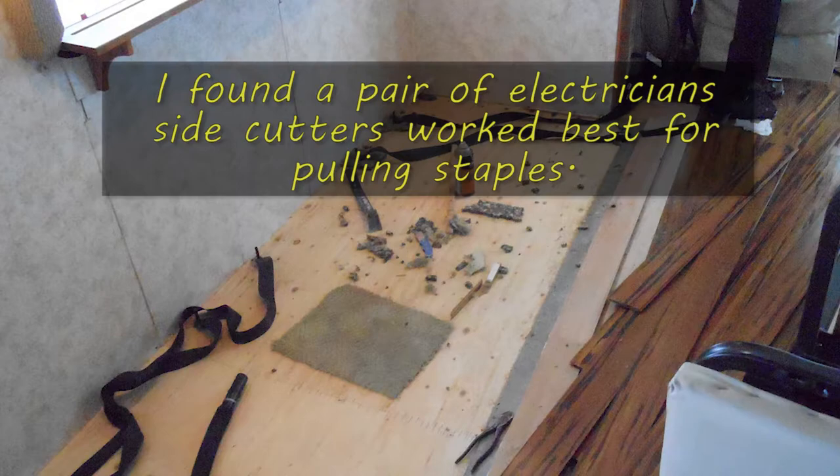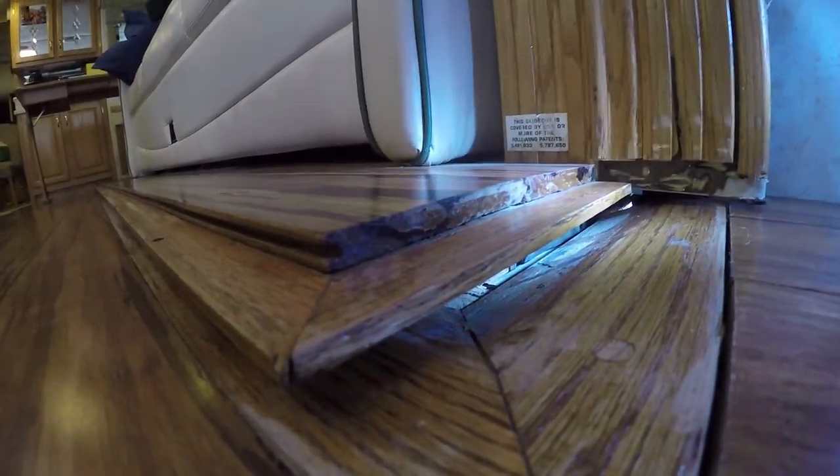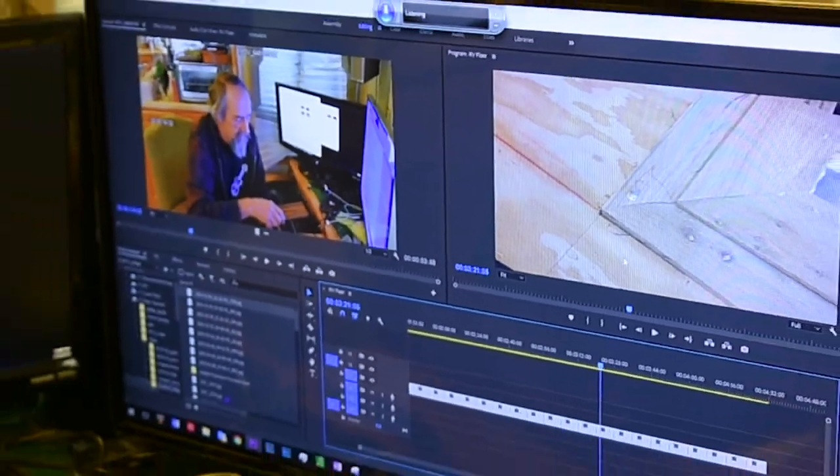Here's an example of how the seam came together — I took some video of that recently — and also the angle of that trim piece. Keep in mind you're mounting these to metal; the metal frame of the slide sits right underneath. I countersunk the screws and used metal screws to screw this to the frame, then used a plug cutter to cut plugs from leftover trim, glued them in with Gorilla Glue, cut them flush and sanded them down. The angle on the trim piece is 60 degrees and the angle on the slide piece is 30 degrees.